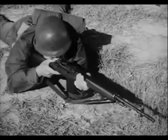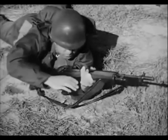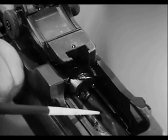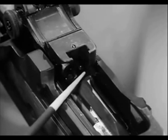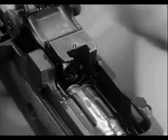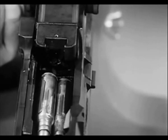To speed up the loading operation for continued firing, the bolt is held to the rear automatically for reloading after the last round in the magazine is fired. This is accomplished by the upward pressure of the magazine follower, forcing the bolt lock into position in front of the bolt. By pulling slightly to the rear on the operating rod, the rifleman allows the bolt lock spring to expand, pivoting the bolt lock out from in front of the bolt, releasing the operating rod. As the operating rod is released, it is driven forward by the expanding operating rod spring, taking the bolt with it. The bolt strips the first round from the magazine for chambering.